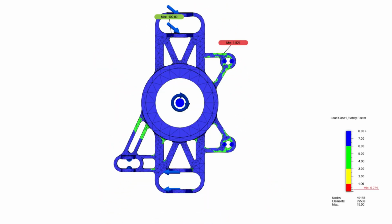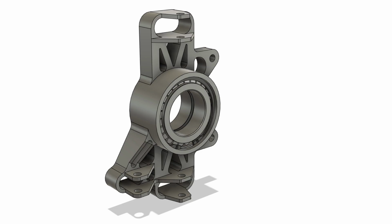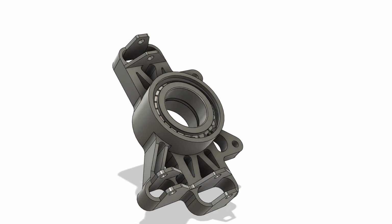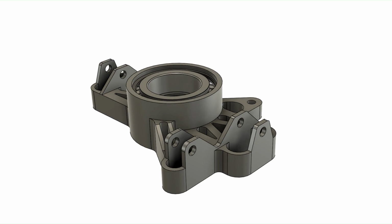Due to the different connecting components and the associated forces, the strength of the supporting material must be of adequate magnitude to avoid complete material failure, as seen here in the finite element analysis using steel. The upright has been designed with milling in mind, with a large flat rear surface for easier mounting during machining. Every corner, interior and exterior, has been curved to accommodate rounded bits used in milling.